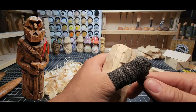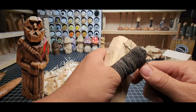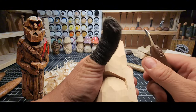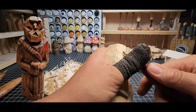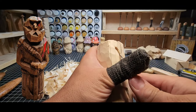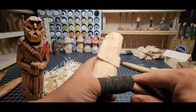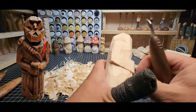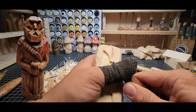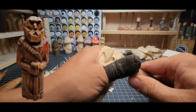Just carving out — make sure you pay attention to the wood grain here. I started one direction but decided to go the other direction because it would have split more than cut. Smooth it out and get a little depth in there. When you're cutting up to your stop cut, make sure your blade doesn't go past the stop cut — just right up to it — and pull all that excess out everywhere you can.